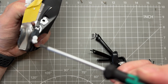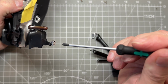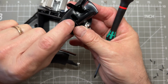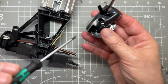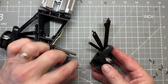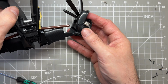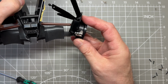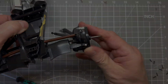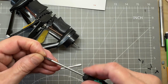There is where the screw goes into this bit here, and there's a slight groove that locates into the position there. The hub, the drive shaft will go into there. So we need to locate this one first. It goes in on a twist, because it won't just push straight in because the screw catches, so it has to go in with a slight twist. Right, so I'm going to put a screw in there to hold it in place.